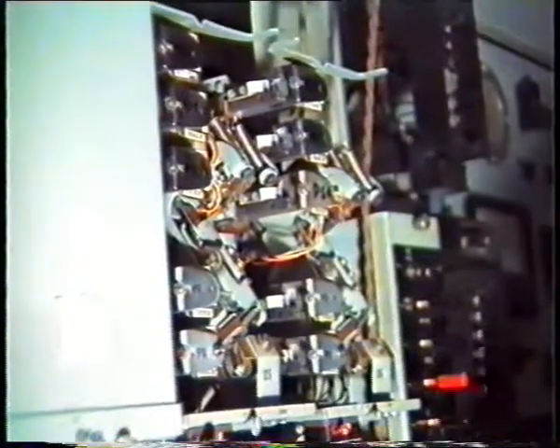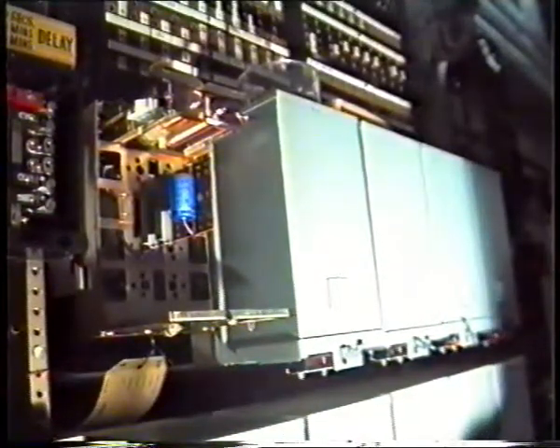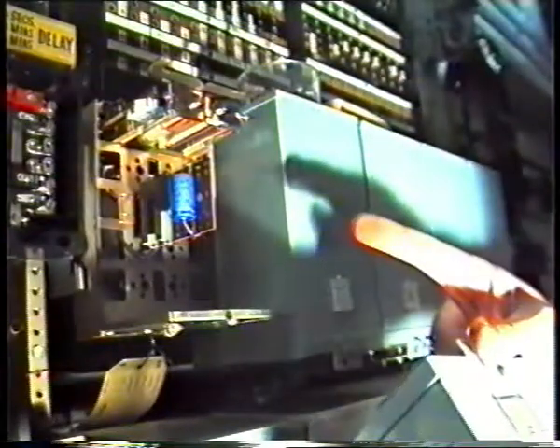That's the three, four, and six-minute delays. This is the nine-second relay — it's done with a combination of two relays. I'm going to simulate that by stopping the selector from releasing. That first relay there operated, and when D releases — sorry, there should be an alarm there, at least it's an operator. I'm going to restore that and the alarm should clear.